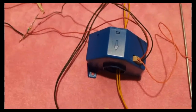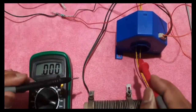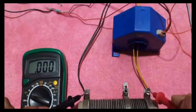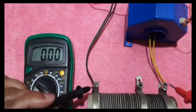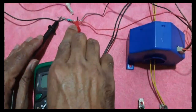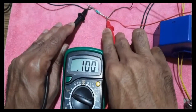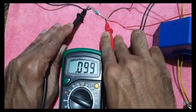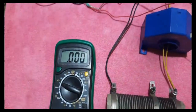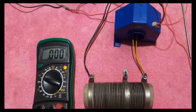Now I will power on the SMPS and see the multimeter reading. I have applied power to the sensor and the load is connected, so current is flowing through the yellow wire through the rheostat and returning to the source. The voltage across the load measures approximately 10.5 volts. The sensor output is reading 0.099 volts — that is 99 millivolts, which we'll take as 100 millivolts.